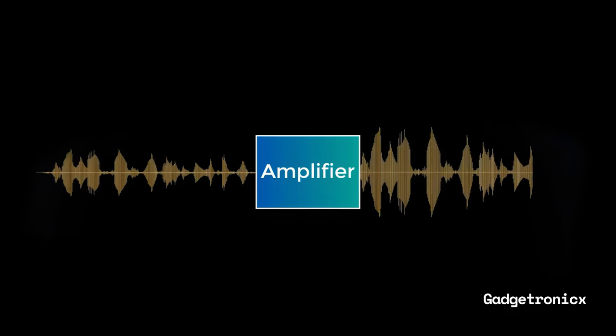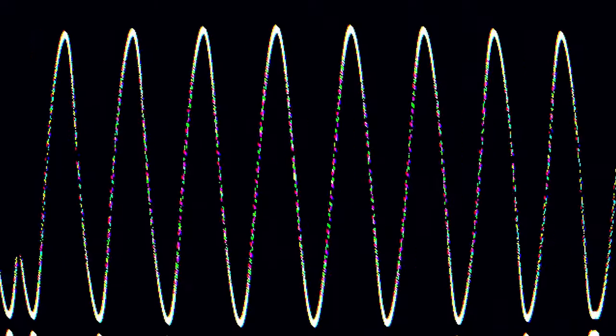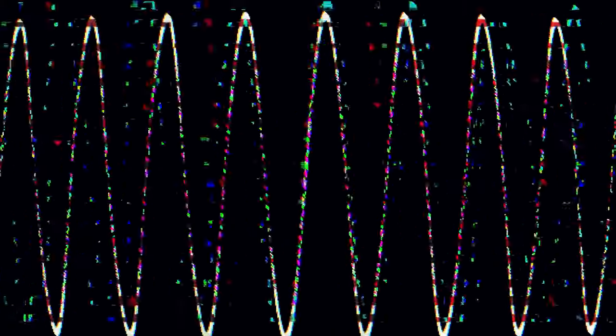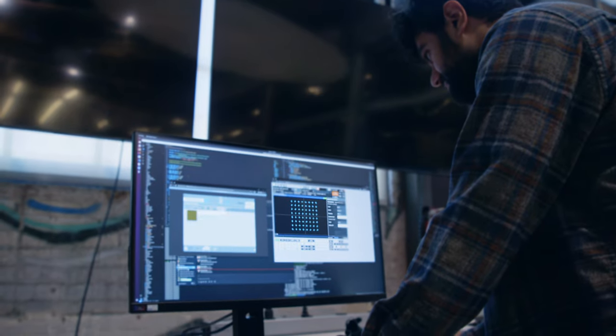One of the most important components of a receiver is an amplifier. An ideal amplifier will take the input signal and multiply it with a gain of, say, 100 or 1000. However, we deal with non-ideal, real-world amplifiers, and they start adding effects such as non-linearity and noise. This generates harmonics and added noise, which all degrade the signal quality.